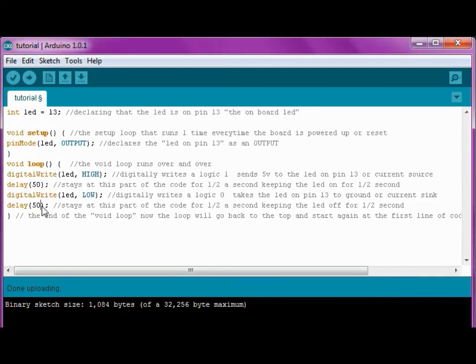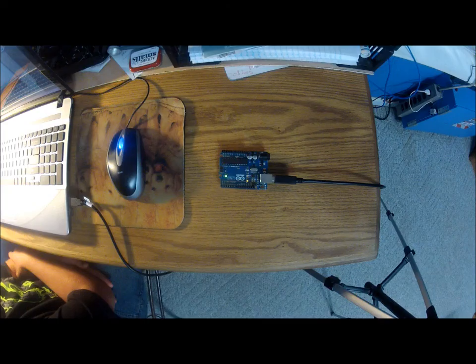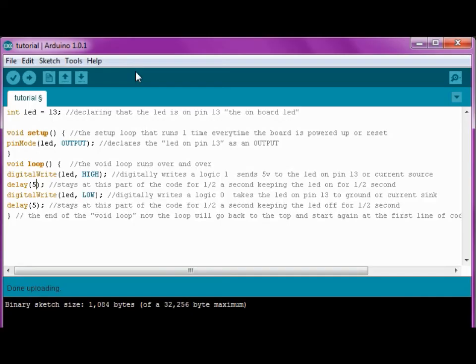Okay, now here's a weird thing that happens. When the LED doesn't stay on long enough, for, like, I'm assuming for you to notice its full brightness, it's not going to look like it's flashing. It's going to look like it's dimmed, which is what PWM is all about. So as you can see, you can't tell what it's doing. It's flashing extremely fast, but there's no way you could ever see that flashing unless you're a superhero, which I doubt you are.